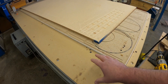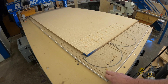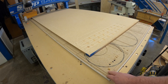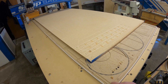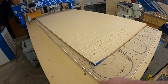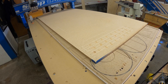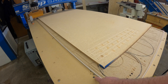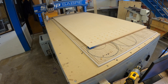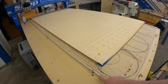When warm-up is done, the machine returns to the back far corner. Our tabletop surface is something we generally don't want to cut into because it needs to be replaced, so on top of our table we have what's called a spoil board. The spoil board — made of MDF — allows enough airflow to vacuum our work piece down, and if we cut into it, it's easily changed out. To line up the spoil board, we pop up the orientation pins on the table using the pin button on the computer control panel.